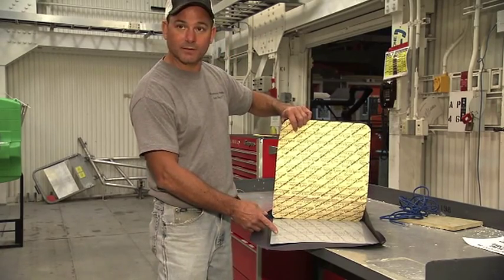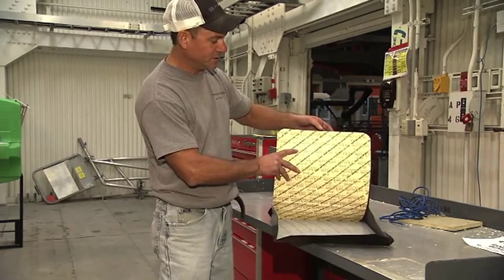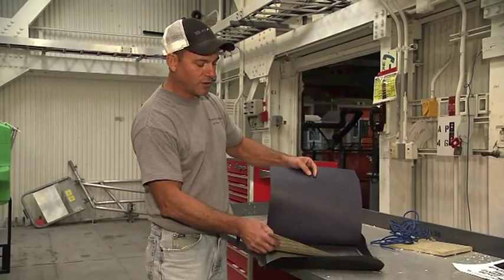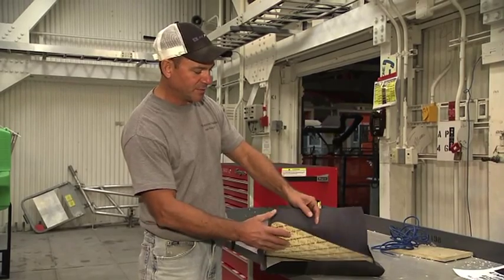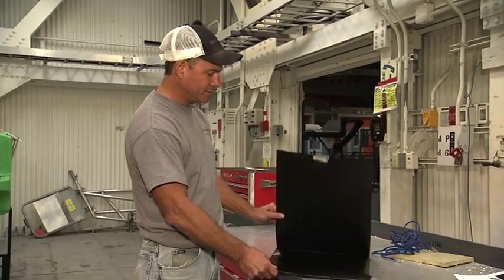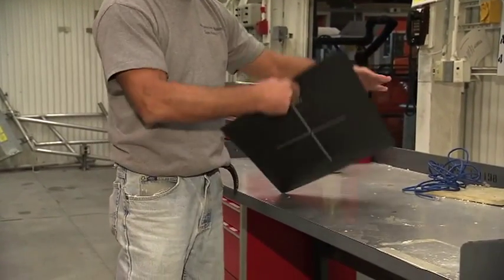This is the image plate that takes place of the old techniques, and this sheet right here is the lead backing for backscatter, to prevent backscatter x-rays from changing any of the image pattern. All this is enclosed up there in a darkened cassette, and then we seal it and it's ready for use.